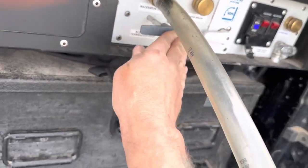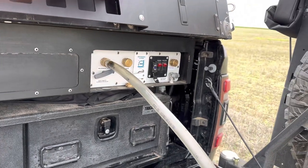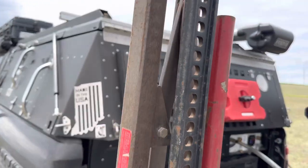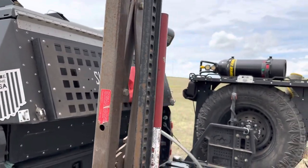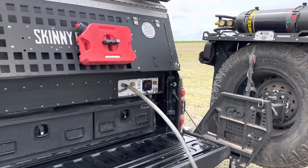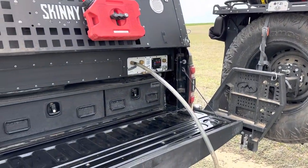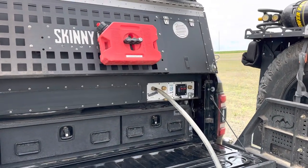After that, what I typically do is go back inside and flush three to five gallons of fresh water back into the toilet, then turn the macerator on again. That'll clean out everything in the macerator and get some nice fresh water in there to clean out the hoses. It's not a bad idea to flush it out after you're done. Thanks for watching.